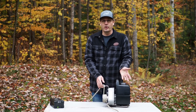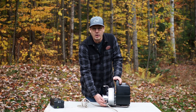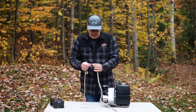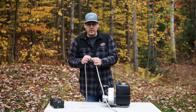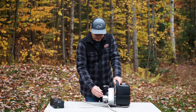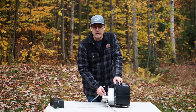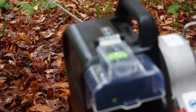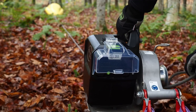When you buy your winch, you'll also be getting a new rope. We can give you a little tip: a rope that's a little dirtier will give you more friction. You can get it a little dirty on the garage floor or add a little dust so it's not completely white — it'll get a little grayish, giving the rope more abrasion. You could also start the engine and use light sandpaper to gently scratch it, which will increase friction. You'll only need to do this once at the beginning — once your rope is sufficiently worn or used, you'll have the necessary friction without any problem. Once you've got the load where you want it, ease off the tension on the rope so that the winch gently sinks back to the ground, and stop your motor.